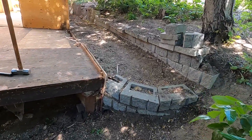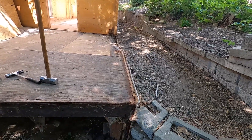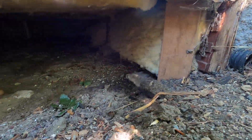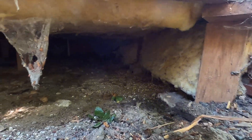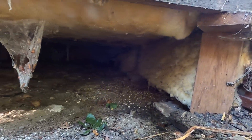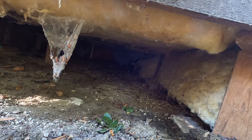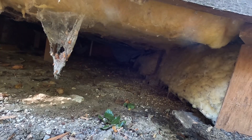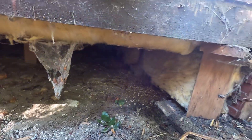You can get a better look here at how they built this — how they just pushed all this soil up against the building after they built the addition. Looking underneath, there's insulation down there but no barrier, which is very poorly done. You want some kind of barrier so that varmints don't get in — mice and rats love to get into that insulation. On the mobile home itself it has a very heavy vinyl underbelly. When I do additions like this I actually put OSB underneath to create a barrier; it also helps hold the insulation up.